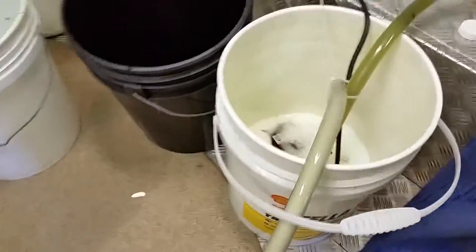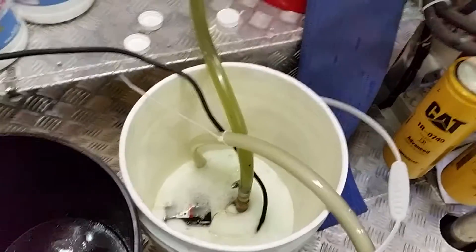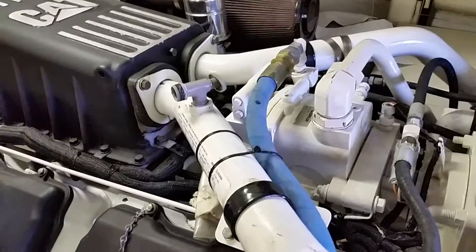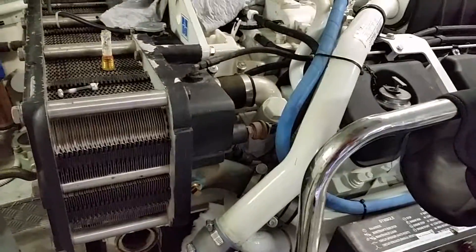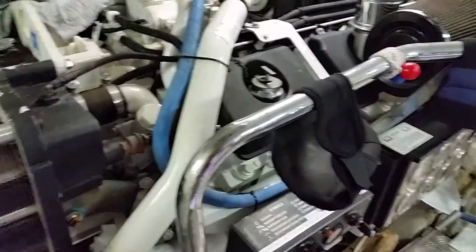I can see my level starting to go down and it's starting to foam up a little bit, so you've got to keep an eye on that. In about three to four hours these engine heat exchangers will be clean — not only the main engine heat exchanger but the top intercooler as well, without removing them from the engine. That's a very costly job, somewhere in the vicinity of about five thousand dollars between the two engines if you had the manufacturer's rep come out and service these motors. We'll stop for now and check back later to see how things are progressing.